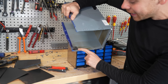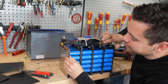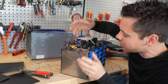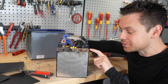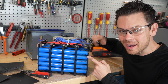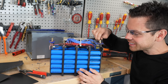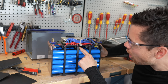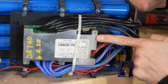It almost burned a hole through the case. Having plastic holding bolts for conductors is not a smart idea — this is such a bad design. Look at how hot these cells got; they're right here. If this copper is getting hot enough to flake off and change color, that means the cells are at a really high temperature as well. And this was used within spec on the datasheet — imagine what would happen with surge loads. This connection with these loose bolts might actually be worse than the positive terminal issue. There's heat damage all the way to the screws, and the cells are discolored.